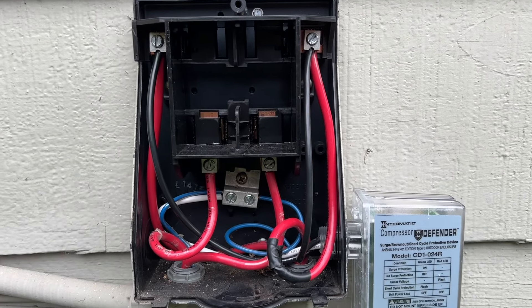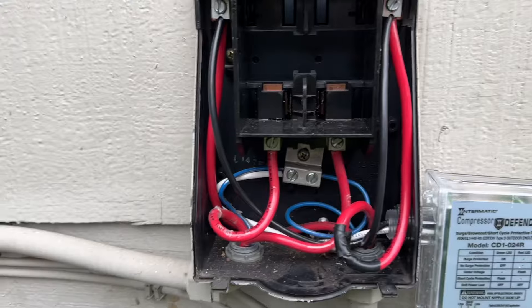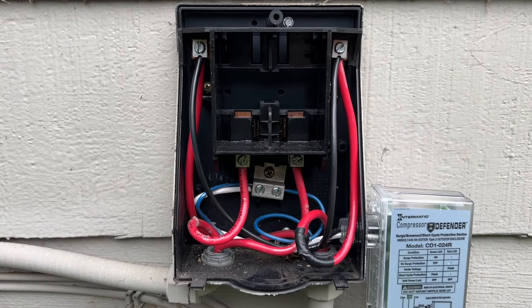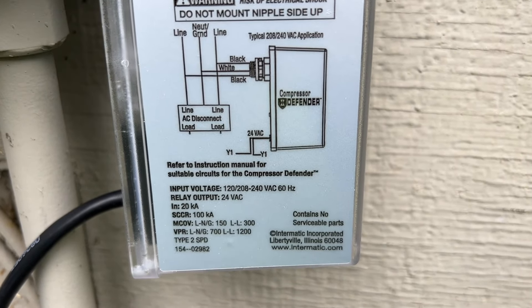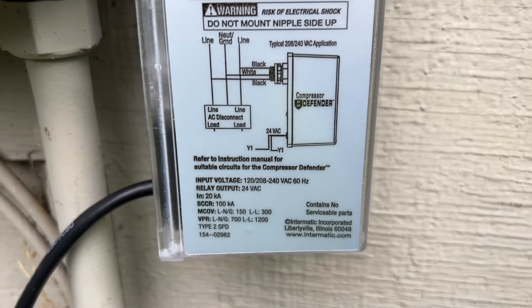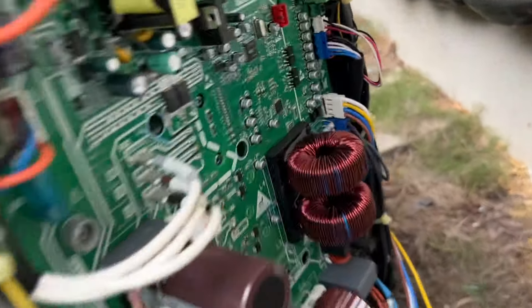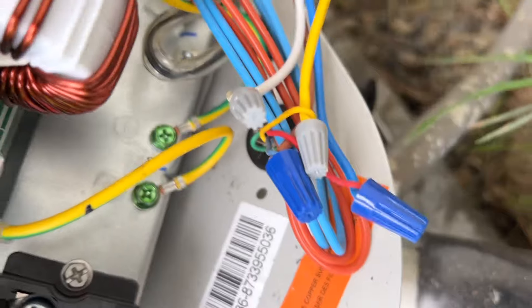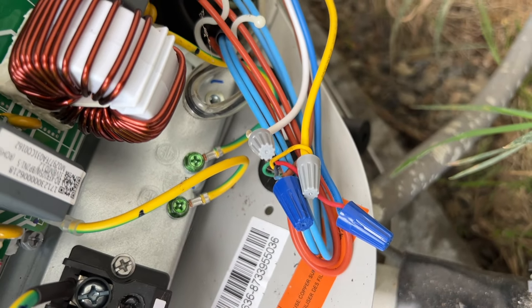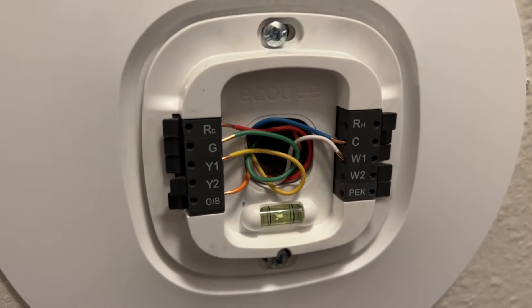There we go. I would have cut the one on the right a little shorter, but I didn't want it to have any tight turns, so I just let it be a little longer to accommodate for that. But it's all wired up. Now we need to focus attention on this thing. The wire on the bottom, according to this schematic, is the 24-volt AC that comes from the thermostat inside. They label it here as Y1, which you normally would find on the thermostat. This thing has a Y, and it's a yellow wire. If you follow it down, it comes right here, which my assumption is wired to the Y1 on the thermostat inside. And according to this, Y1 is the yellow. I got some wire nuts.